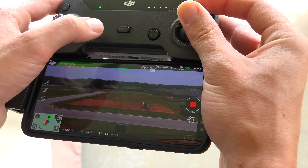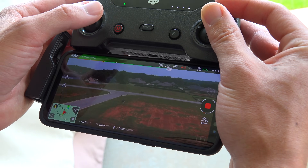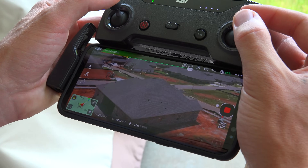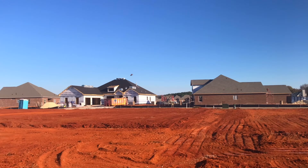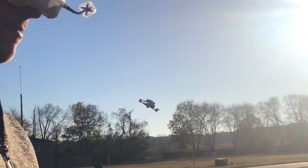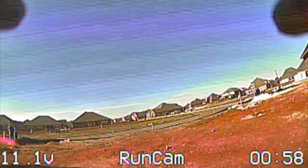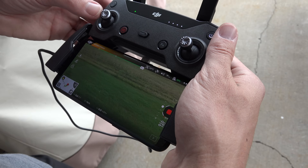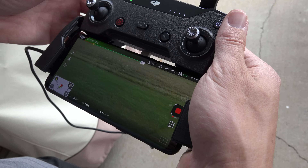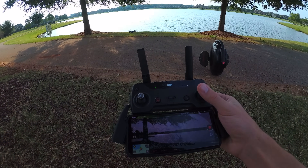The conundrum is the video latency between this incredible little 1080p video camera on the Spark, transmitting through the air to the remote and then to your phone — it's just too laggy for nimble racing. The pros, when flying around at 50 to 100 miles per hour in drone racing, need very low latency for response time. They most often use an analog signal with roughly 25 to 40 millisecond latency. With the Spark, its built-in video latency is more in the 160 to 200 millisecond range — that's more than four times slower than analog.